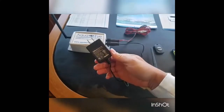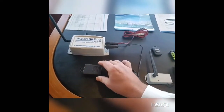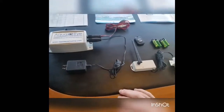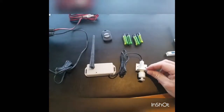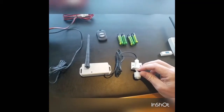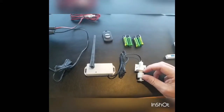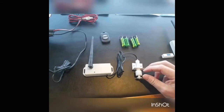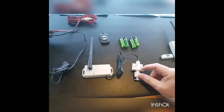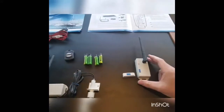If your boat has shore power, you plug this into an outlet and it will let you know if your boat loses its shore power. This is the high water float sensor. You place this someplace probably close to your bilge pump, and if the water exceeds the point where this float goes up, it will send a wireless message to the base unit, which then sends a text to whatever users you want.